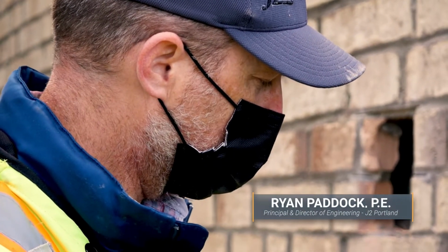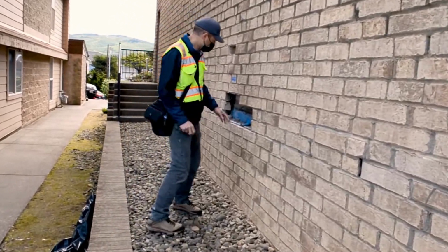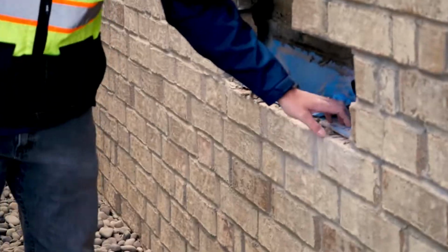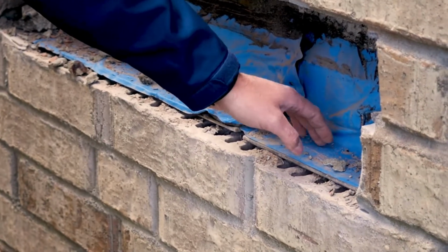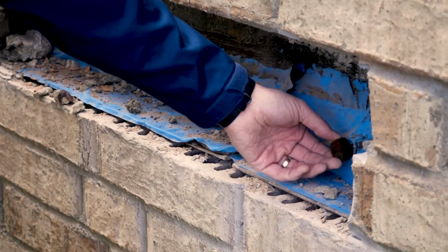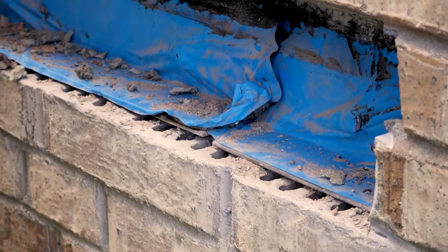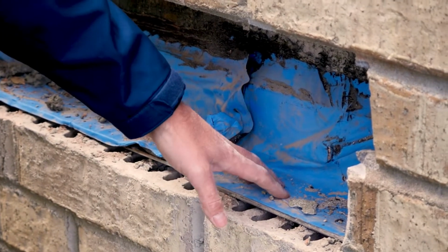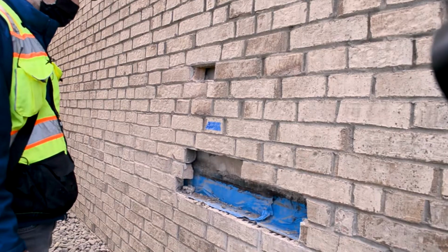It's hard to tell exactly why, but there are these steel angles. This steel angle vertically supports the brick, and it looks like this one's been replaced recently. And this was a nut that was holding that on that popped off. So it's hard to tell if there's movement in the lintel, or if there's just expansion and contraction in the veneer relative to the wall.